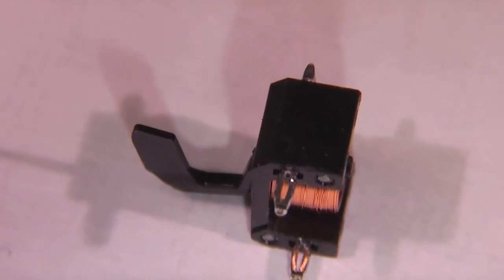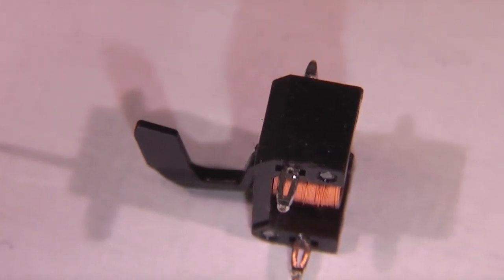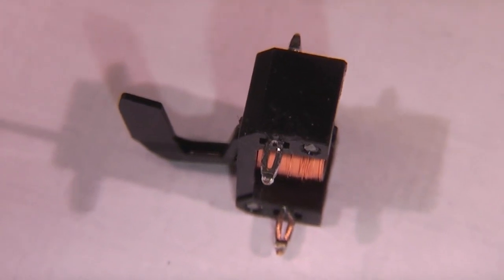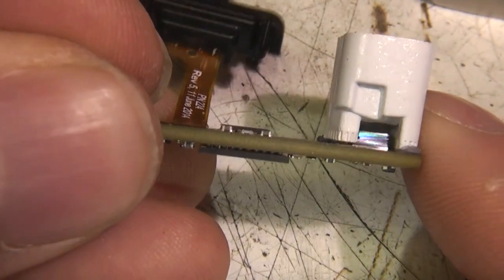And you can see these pins are specifically designed to be press fit. They've got this hole in the middle so that they actively spring against the side of the hole. This is a fairly common technique. You can buy Samtec pin headers with these, for example, so you can just press fit them into the PCB instead of soldering them.